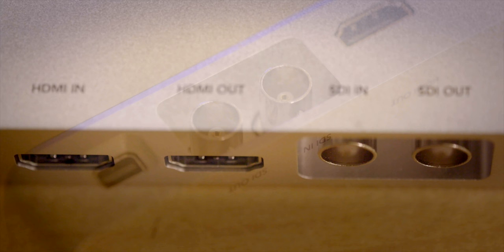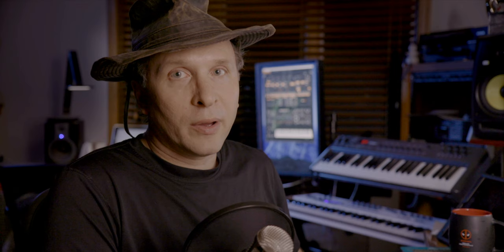If you don't have a spare one laying around, you're going to need to go order yourself one. I've used both 1-meter and 2-meter cables and they've all worked just fine. Built right into the box are probably the two most important connectors: SDI in and out and HDMI. The SDI is 3G, so you can do 1080-60.